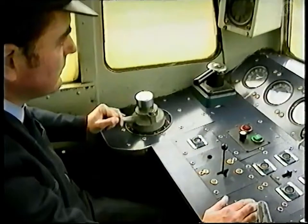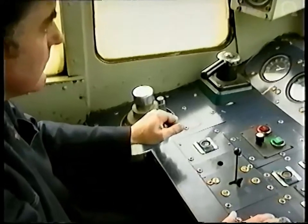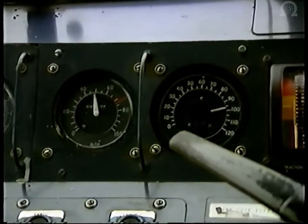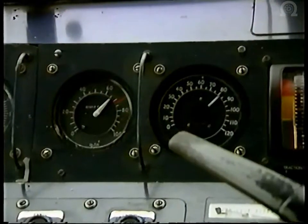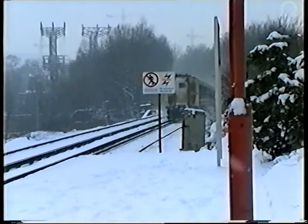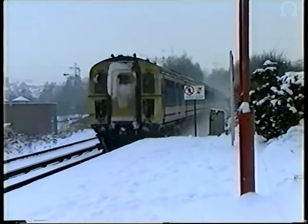So what's the message? In snow conditions, carry out a running brake test every three to five minutes. Put the brake in full service and leave it until you can feel a good normal rate of retardation, reducing the train speed by at least 10 miles per hour. You have now cleared the water from the discs and conditioned the brake. In service stops to stations or signals at danger, or in slowdowns to speed restrictions, brake earlier than usual and always start with a full service application, then reduce the braking as required.